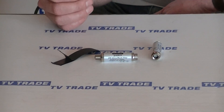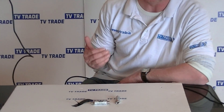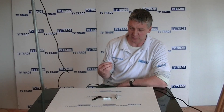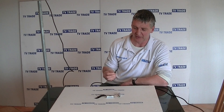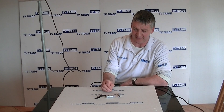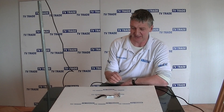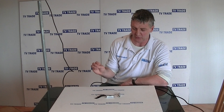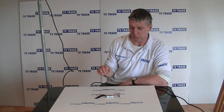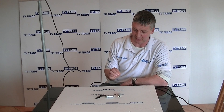Why would we need this particular filter? Well, with the launch of the 800 MHz 4G broadband service there's a real potential for people to suffer interference on their Freeview reception, simply because the bandwidths are so close together. This is a highly effective filter at filtering out those, and if we look at channel 63 - which is just over the 800 MHz into that range - it offers a filtering effect of 55 dB, which is higher than any other filter I've seen on the market.